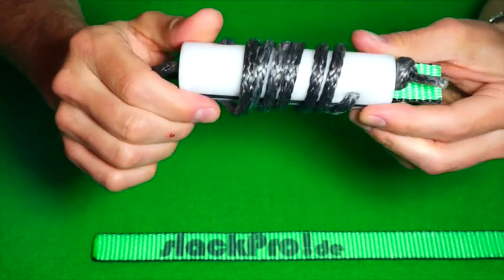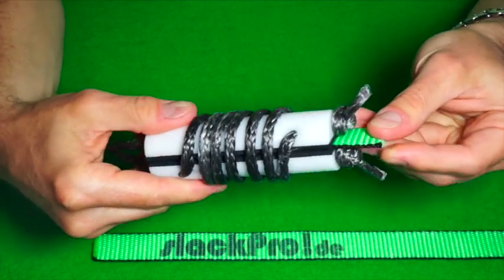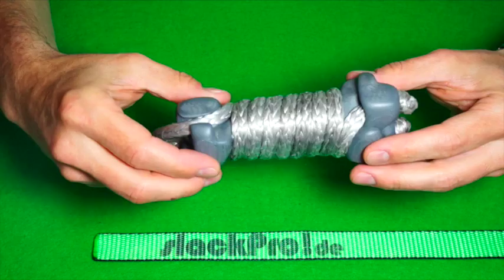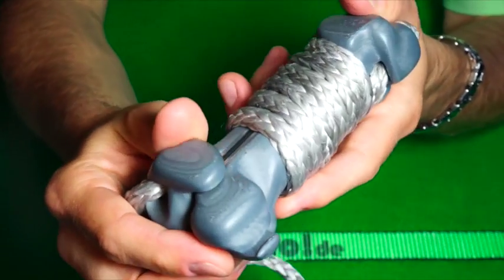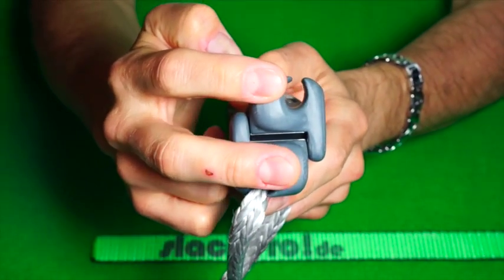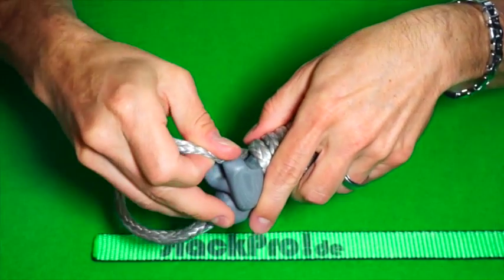This is in a way comparable to a Prusik knot used for ropes, only that we have two specially designed clamping modules that guide the rope and transfer the pulling and the clamping force to both surfaces of the clamped flat webbing. Here I have a handmade carbon fiber prototype. The LineCoil will be manufactured from aluminum 7075 or fiber reinforced plastic, and features unique rope-guiding elements such as these organic-shaped channels and massive diverters that bear a great deal of the load. All of these features ensure the least friction and stress on the rope as they correspond to the natural rope flow.